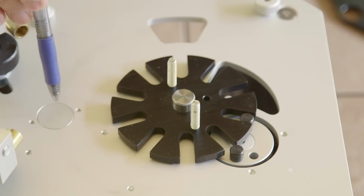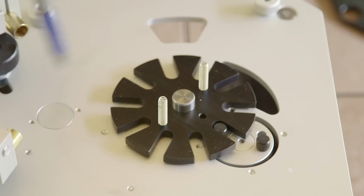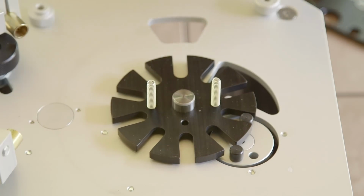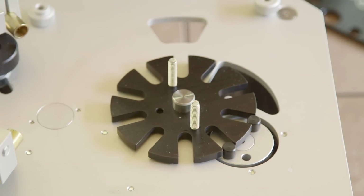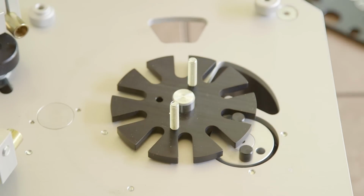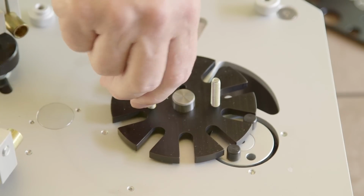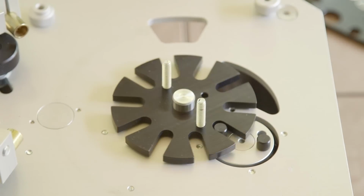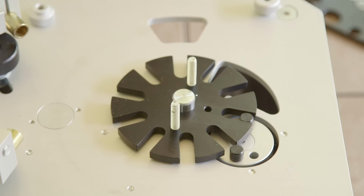Now here's the rotator right here. So this goes and then this goes. And that, of course, operates for the specified period of time. One other thing about the Geneva movement is that you'll notice that at all times, the black indexing Geneva wheel is engaged into the pins. There's never a point where you can freewheel it. You just can't do it. I'm putting pressure on it, and it's going to turn, and it's never going to get out of sync. It won't get into some intermediate position where it could jam up and so forth.